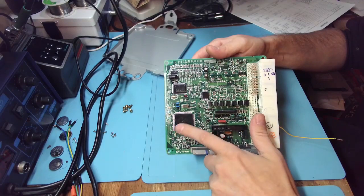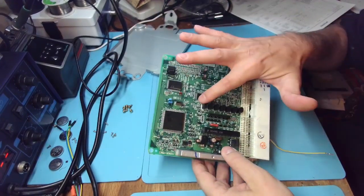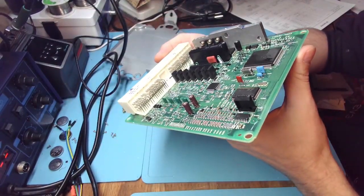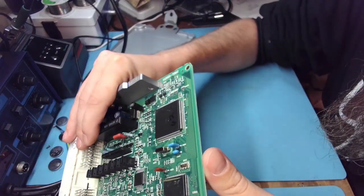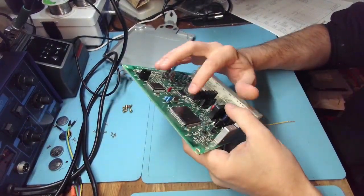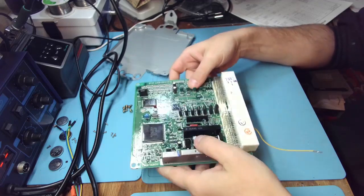As you can see, we have a big controller, a smaller controller, some other chip over here, and a whole bunch of transistors over here. These transistors are C5293 - they are bipolar transistors. I couldn't find the datasheet for them, but they are available should I need to replace them on AliExpress.